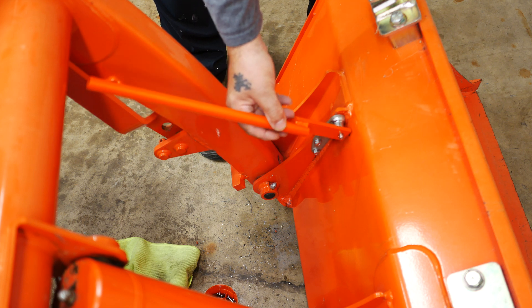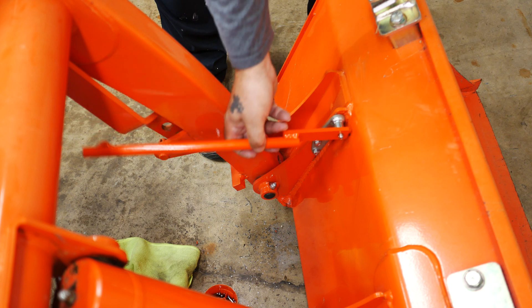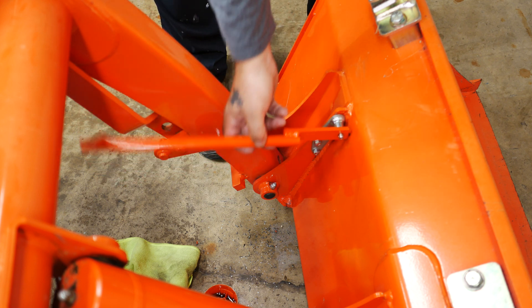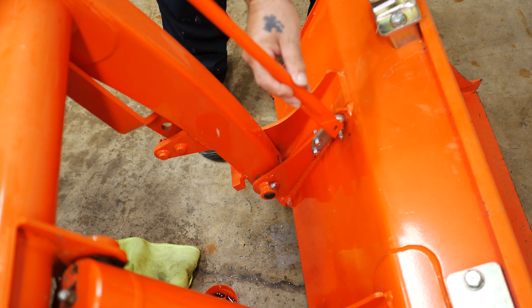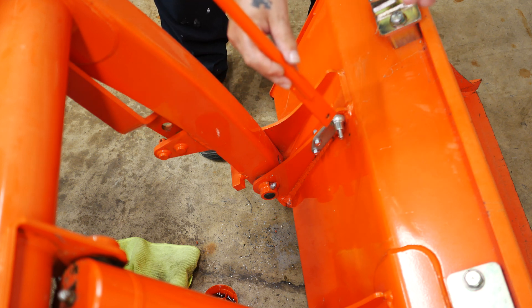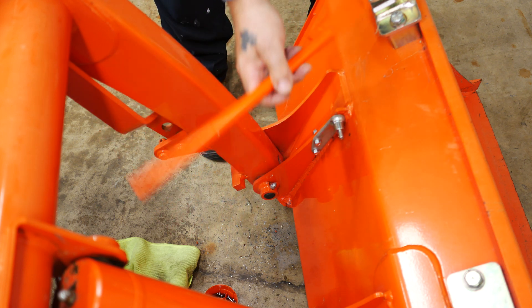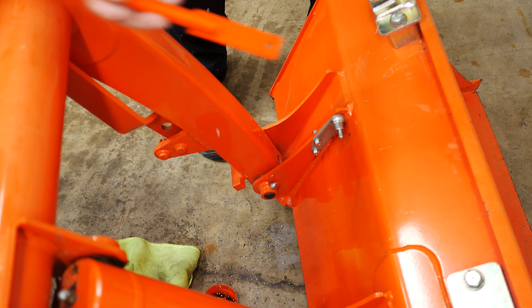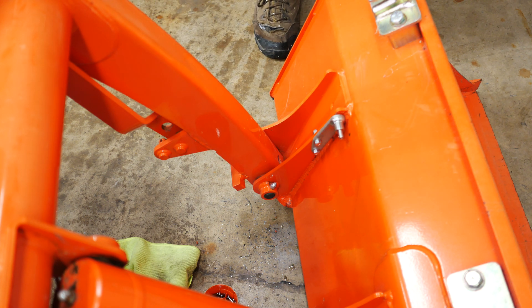Like I said, this isn't made for this, so I'm going to have to do a little improvising. The first improvisation is to round these edges off so that this swings freely. Otherwise, when the bucket goes to completely drop the load of dirt or rocks, this is going to break the telescoping rod. Let me get this fixed and I'll be right back.